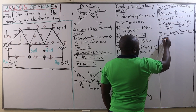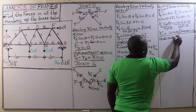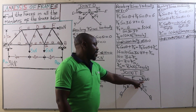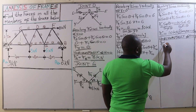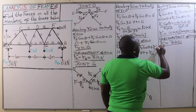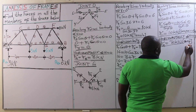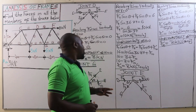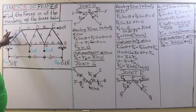After resolving the forces vertically, the next step is resolving the forces horizontally. F4 is going to be 8 kilonewtons, a compressive force. Therefore, ladies and gentlemen, we now have all the forces on all the members of this truss and we can fill them in.